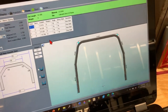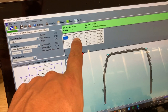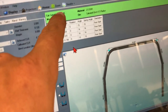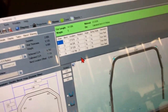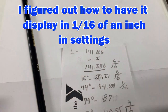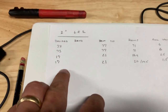Learning from my mistakes, here's the tube I'm going to be bending. I'm using the BendTech software, which gives you the location to start each bend and the number of degrees to bend. One thing I'm doing is modifying the numbers slightly because I'm going to put the fish mouths at the bottom of the tube before I bend it, so I don't have to bring my fish-mouthing tool to an already bent bar — I can notch a straight one. The program gives everything in decimals, so I converted to sixteenths of an inch and subtracted a quarter inch across.